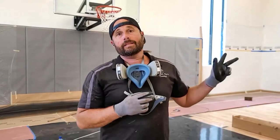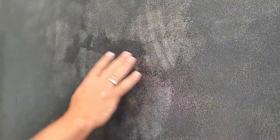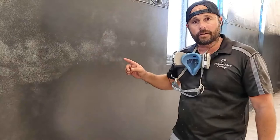You can see, follow me over here real quick, Jose. The reason why we're doing this, and I know it may seem crazy to some people, but you go up to this, it's already dry. So what we're doing is we're kind of prime sealing all of these patches. It's a great way to see it. I couldn't have actually imagined a better way to see why we do this, especially if you get down there and look at the glare wall of it. If we went any heavier with an ultra deep base, it would never dry and we'd be here all night. By doing this, we're sealing all of our patches, and at the same time, we're giving ourselves a chance to do two coats within not too long of a period of time. So we're gonna continue doing this. We'll check back in on the final.